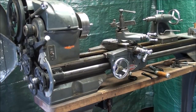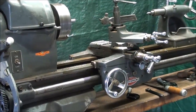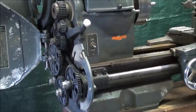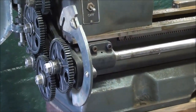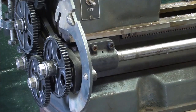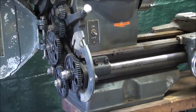I've had requests over the years to do videos on cutting metric threads, and now I'm actually doing it. It's not something I do very often, but it certainly can be done on this type of lathe. It's easier if you have an import lathe that already has that capability on the quick change gearbox, but here we have change gears that I'm going to change. In a later video, I'm also going to put the quick change gearbox back onto this lathe, but you will see that you cannot cut metric threads using the quick change gearbox — you need the change gears. So let's step over to the bench now.